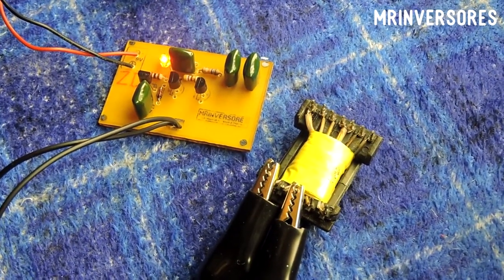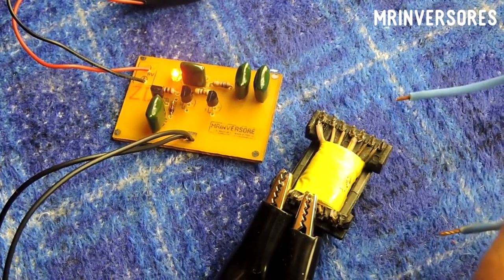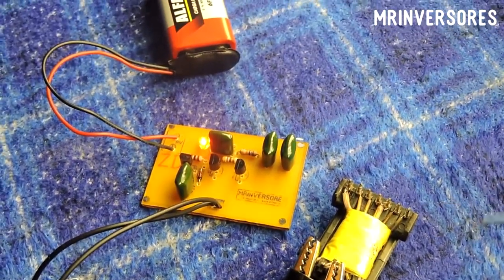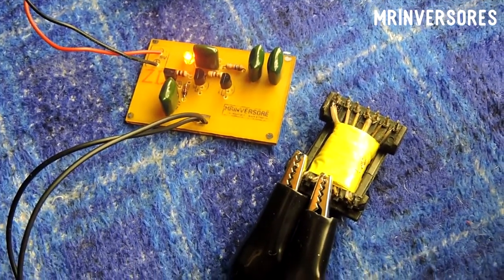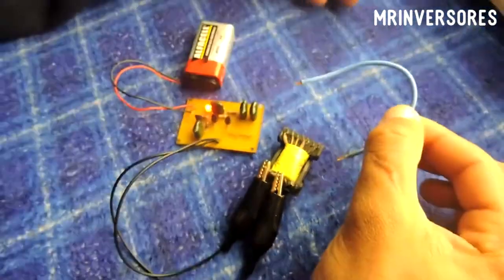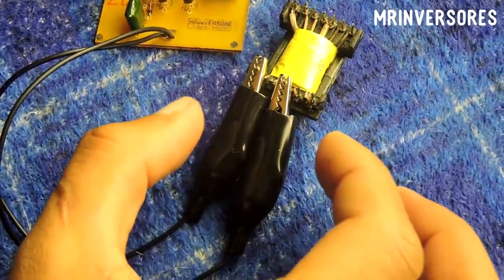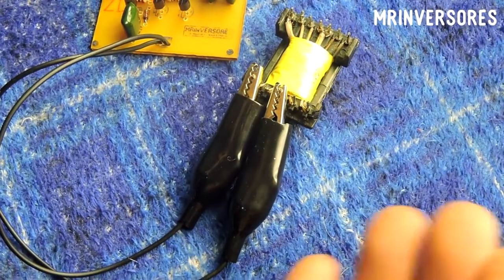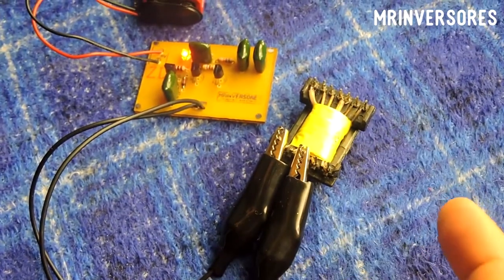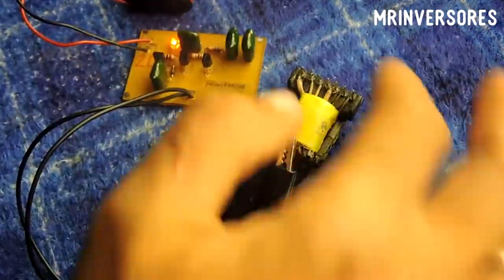I made this for the subscriber but I'll build one for myself too, because this helps a lot. You don't need to disassemble transformers to find out if there are shorted turns or shorted windings. It's a very simple project that makes life much easier for a technician on the bench. I bought alligator claws for him because some transformers have longer terminals. For small transformers you can buy a smaller, thinner alligator clip to reach the terminals — and that's it.